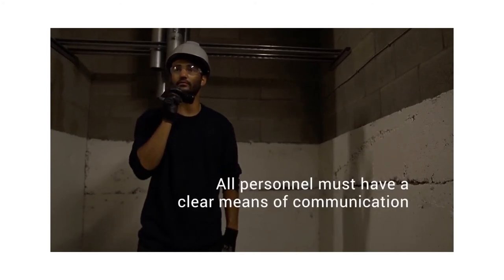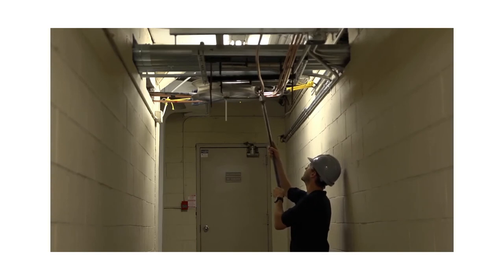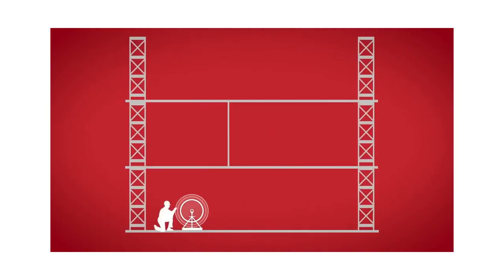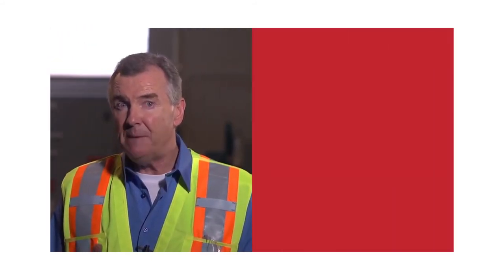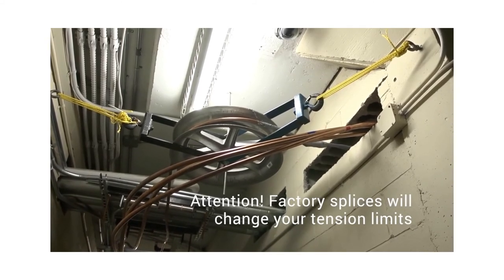All personnel should be equipped with radios or another effective means of communication. Keep one person at the front end of the run holding onto the reel to provide some back pressure. Another person should be placed at the tip of the cable, following the nose or basket, to ensure everything is going smoothly as the cable goes through all wheels and supports. For more complex runs, try to keep two people located with the tugger — one with the radio and one keeping an eye on the tension gauge. If there are multiple stories or floors involved, position additional personnel at each level to watch over key supports and bends. Slowly start pulling in the cable, with the person supervising the nose following the cable from behind the attachment and never getting in front of it. Ensure the swivel head does not get hung up as the cable is pulled over the rollers and bent through the wheels. When a factory splice is present, manual assistance should be used as splices need to be carefully pulled over the wheels, and remember that your pulling tension limits will change when a factory splice is involved.